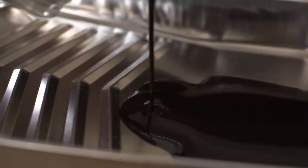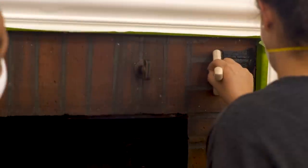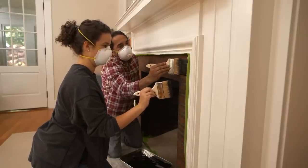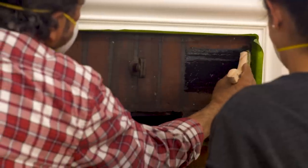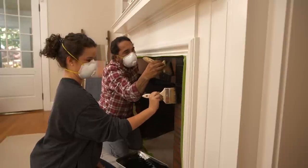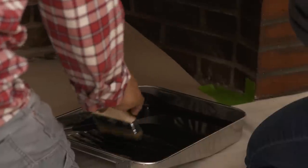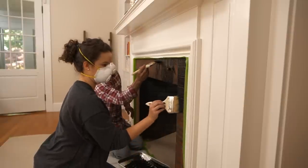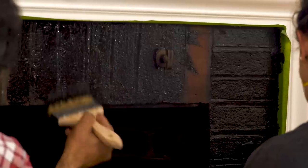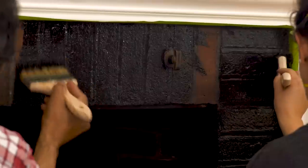So what kind of paint are we using today? We're going to use a flat black high-heat-resistant paint. This paint is specific for this kind of area exposed to heat — it can handle 1,200 to 1,400 degrees. Don't put a lot of pressure; this paint is thin enough that it might drip and run a little bit. I'm going vertical because we want to make sure we have good coverage, and I also want to make sure we cover the mortar really well.